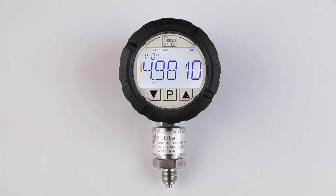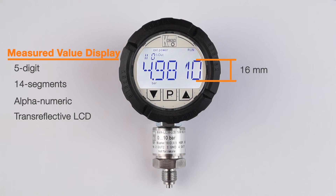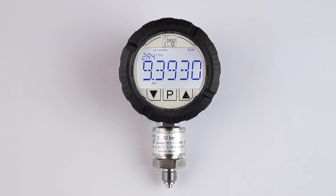The large digits show the primary value displayed. The primary value is shown on a five-digit, 14-segment alphanumeric reflective LCD display with a digit height of 16 millimeters. The large and bright display ensures easy readability even from a 20-foot distance. The primary value may be defined by the user as either pressure or force, with engineering units shown in the bottom line.